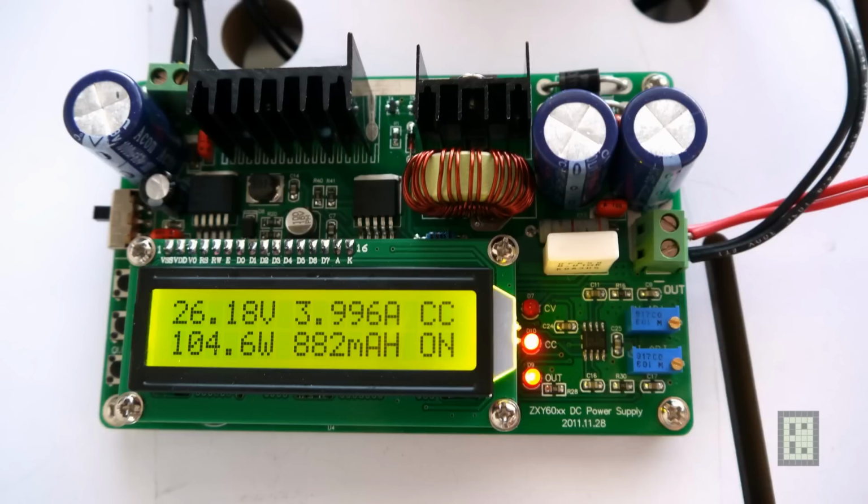And I also used two AC adapters in series. They are 19 volt each. But since they are not electrically insulated inside, you cannot directly connect them in series. So for one of them, I used an isolating transformer. That way I could connect them in series for a total of about 36 volt. And I set the output, I think, at 28 volt or 27.8 or something like that. Not very important. So I will get about 3.5 volt per cell if they will charge equally. Okay, so this is what I used to charge them.